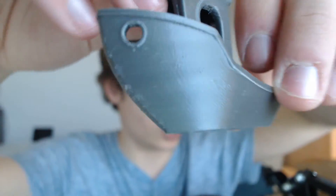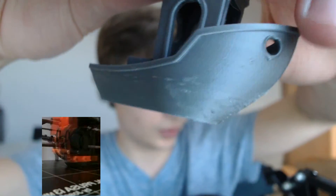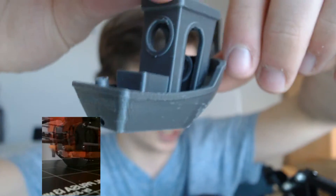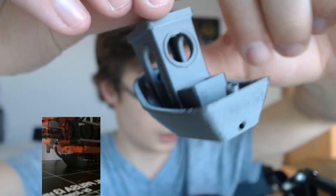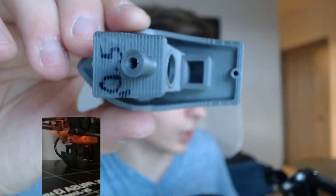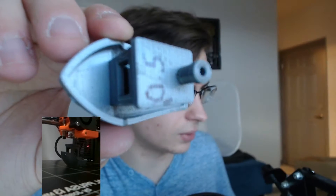And I found something very interesting. So this is the 0.05, and it's very shiny. There was a little over-extrusion there, but it's really shiny and everything is perfectly clear. The overhangs are very nice. If you look at the top, aside from my marking, you can see the stair-stepping effect is still there, but it's not that bad whatsoever.